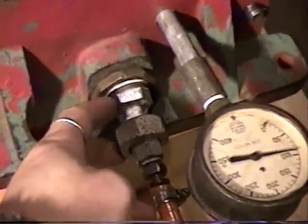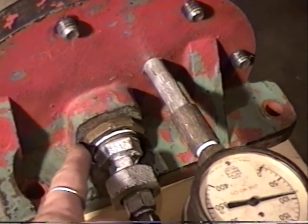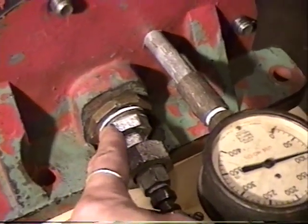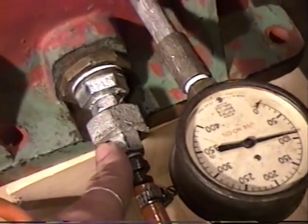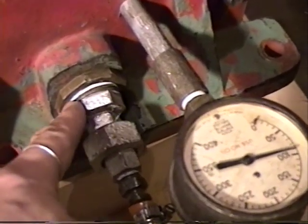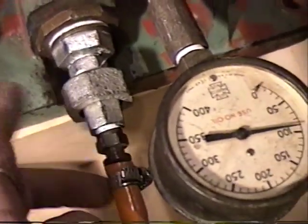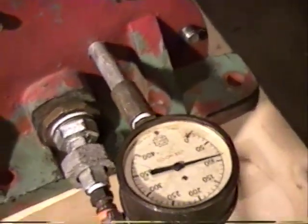Okay, I took it apart here. This is a brass thing that was in it when I got it. It used to be a big, huge air cylinder, as in it had a piston in it, and the piston shaft came through this brass bushing, and I altered it. I had somebody put some threads in it so I could thread pipe into it here. Before I took it apart, I forgot to figure out exactly where the leak was coming from, but it was one of these joints here. So I took it out and put more Teflon tape on it, and I tightened this. That was not very tight. I tightened this going into here, and I tightened the screw on the hose clamp, and I tightened this joint and put new Teflon tape on, and put it back together. Now let's see if it still leaks and see what happens.